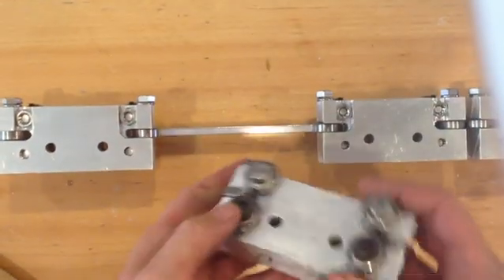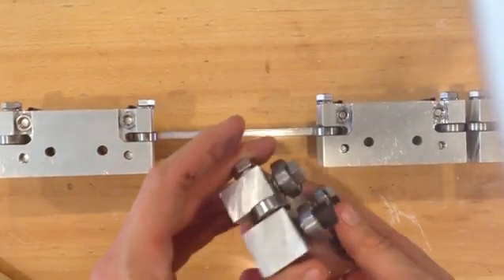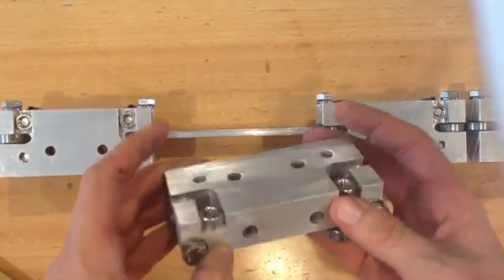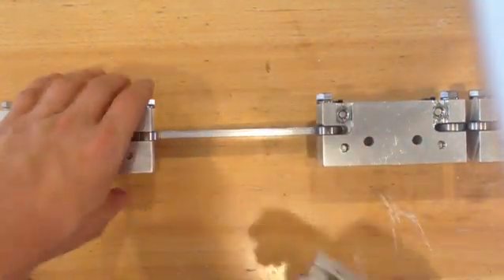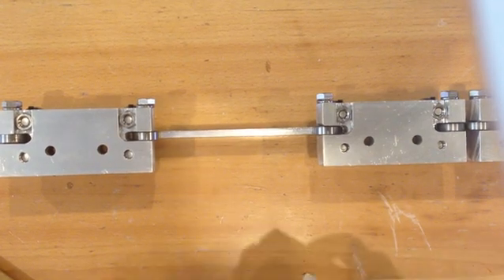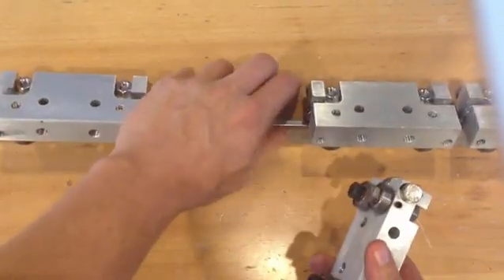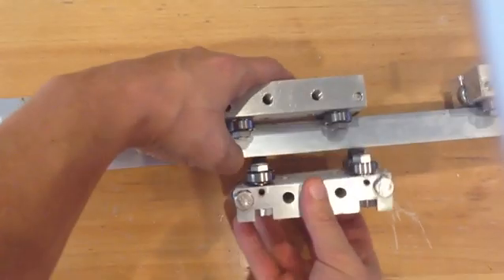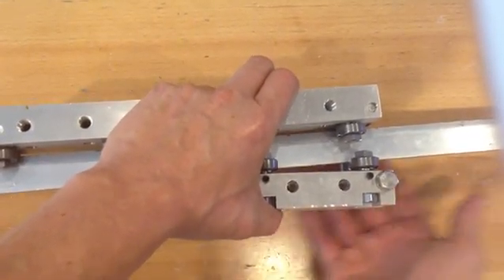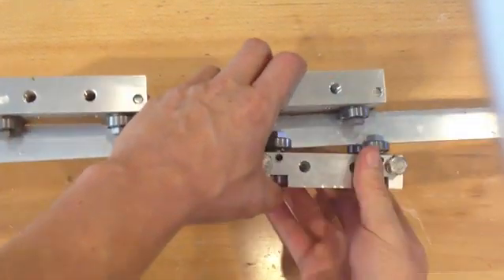Let's go ahead and pop one of these babies off. I just have some placeholder ones, but basically it just uses skate bearings. We have set screws on these sides to push these in together so they grip tight on the rail. Now, this rail here I have is just a little bit of aluminum I had laying around just to test it out. Basically, two of these get ganged up together so that they're on either side of the quarter inch rail. Beneath this would be the actual support system — it's going to be 2 by 6 rectangular tubing.